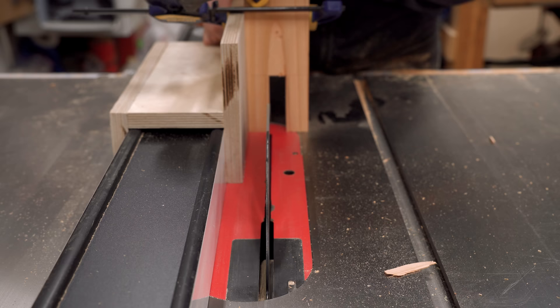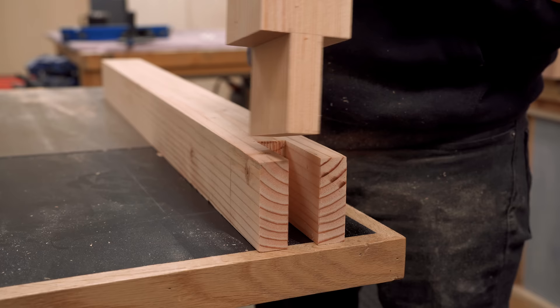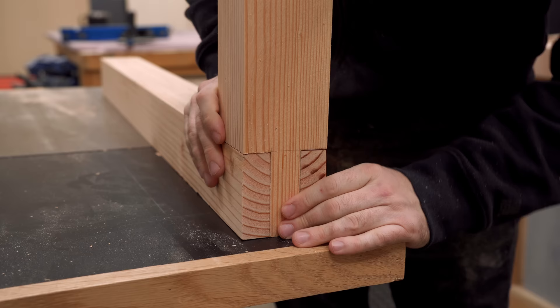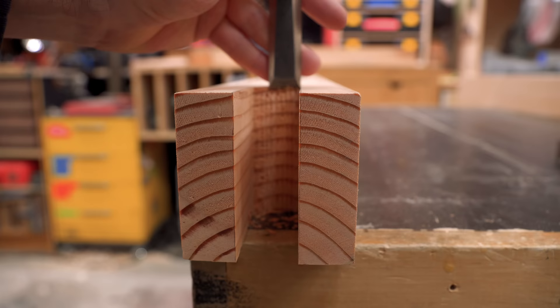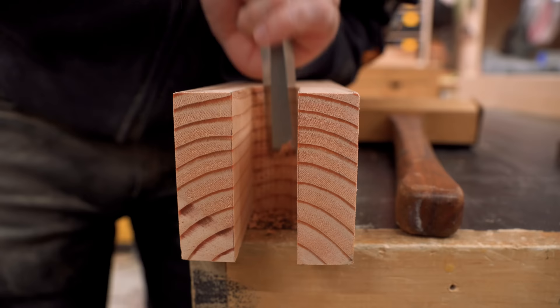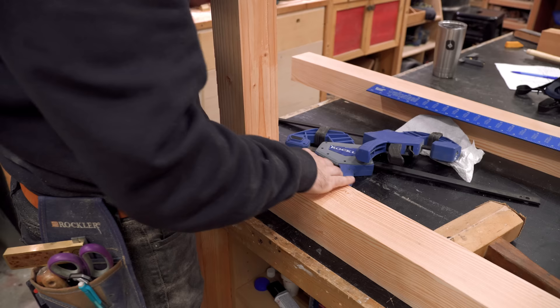I've intentionally undercut this joint because I want to sneak up on the fit - this is the essential part, this is where most of the times I've messed this joint up. So I took my time, made multiple cuts again flipping back and forth on both sides to keep it symmetrical, and test fit the joint until it was just right. Ideally I would have had a sharp flat-toothed blade to cut this with and I wouldn't have to deal with cleanup on the top edge. Unfortunately I didn't, so I ended up chiseling out the little grooves left by the table saw and that allowed me to tighten up the joint a little bit more so that it would glue up without any seams.